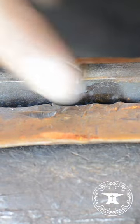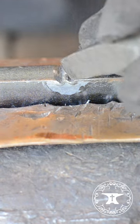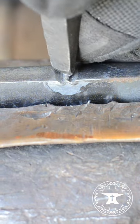We're going to come in here and do some roping with a small forging chisel. We're going to start at a diagonal and at a severe angle, dropping way down low to try to get the bottom of it and creating a crease. Then you're just coming up and slowly rocking over the top.